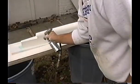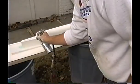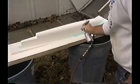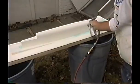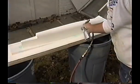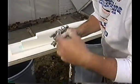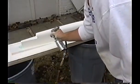As always, the Brodak primer just flows right out beautifully. You can see how nice that fillet area is building up. There are some imperfections in it, but we're about 90% there. This may need one more sand out. The thing I wanted people who watch your video to understand is you don't do this in one shot, in one minute. It's sanding, fixing, over and over and over, and eventually you do get there.